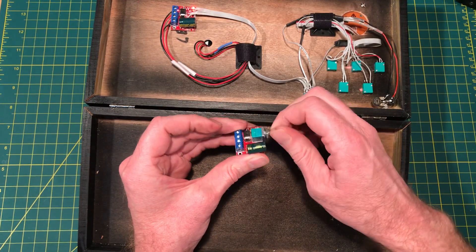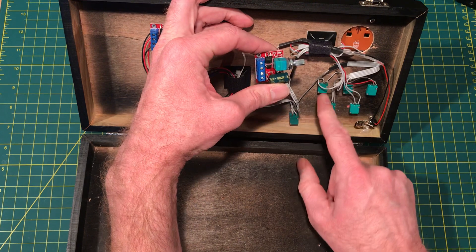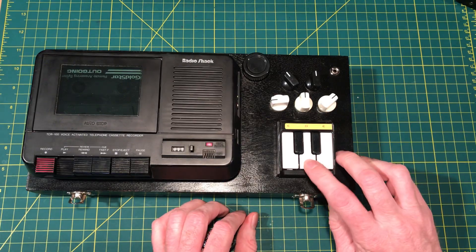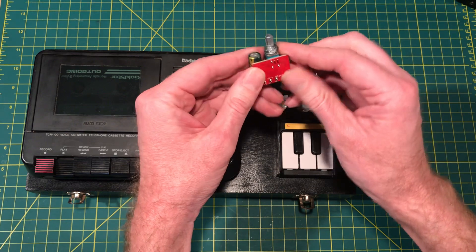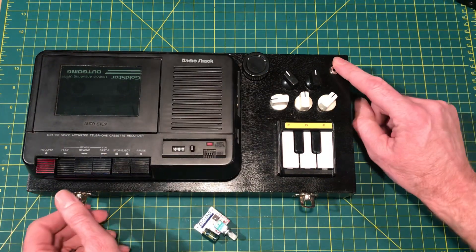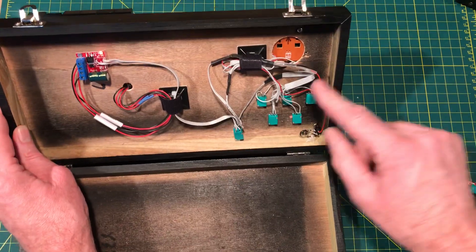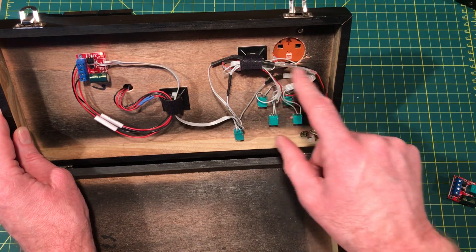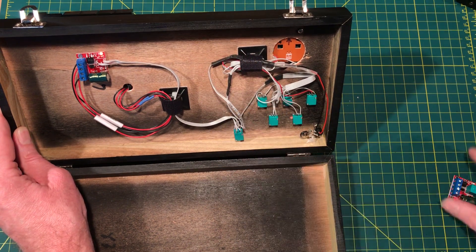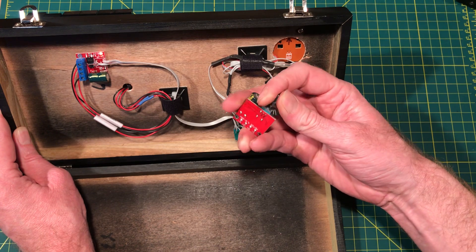This one control sets the speed — that's basically all we're doing. I'm just tapping into that one control for all of these other keys. Each key is just a latching connection, or just a momentary connection, between two points on this pot. They all have their own individual tuning pot. For the CV input, it wires in through a trimmer here, and then through a little DIY Vactrol — an LED with a resistor that goes to a light-dependent resistor — wired back to the same two control points on the speed adjustment on the PWM board.